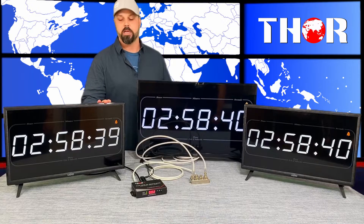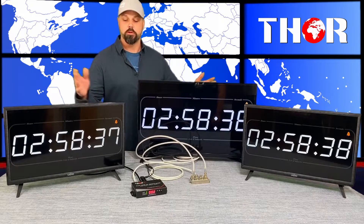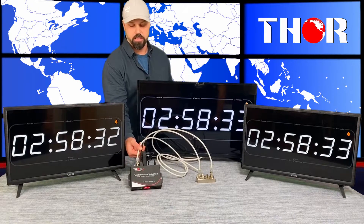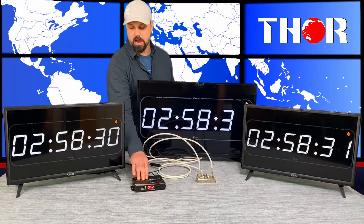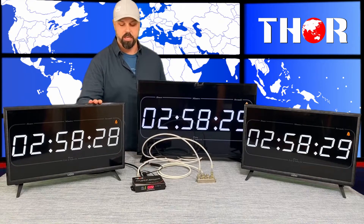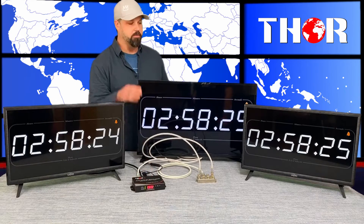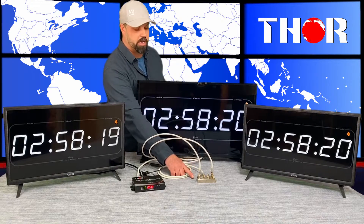This TV over here is playing a timer showing a streaming clock that is actually coming from a Roku stick right there, and the HDMI loop out in live real time is going to this TV. The RF output is going from the actual modulator itself to these two TVs, going over a very simple architecture using a 1x8 coupler.